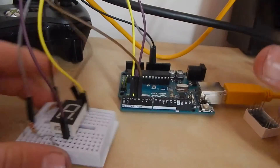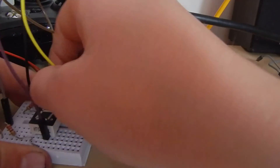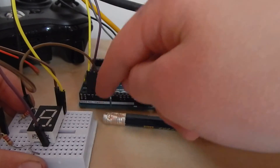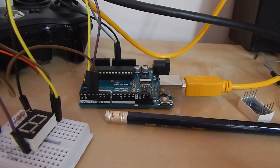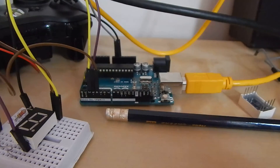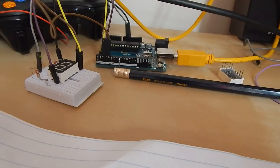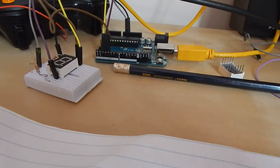If I wanted to do the same but to make a 1 instead, I would simply change it so that if you're wiring up all the pins, you just send voltage out of the pin that segment is attached to instead. Anyway, that's it for today — just briefly showing you how 7 segment displays work. There is also a library you can get which saves doing all this, and there's a way to do it using arrays and functions, but I haven't gone into detail about that today — maybe in a sequel. Thanks for watching, hope it's given you a little introduction to 7 segment displays, and I'll see you next time.